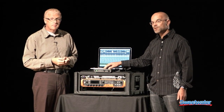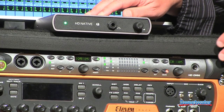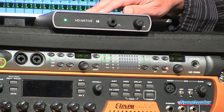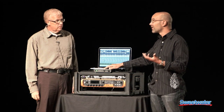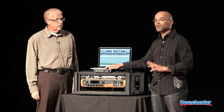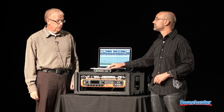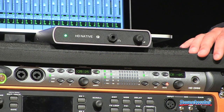One of the very cool features in this box is the built-in headphone amplification. This is a new development — we took the headphone amp from the HD Omni, which is already a very good headphone amp, and improved upon it. We gave it a lower noise floor and even more output, so you can hook up headphones up to 300 ohms of impedance — typically the ones that are hard to get volume out of — and there's more than enough volume. It's a very clean, clear-sounding headphone amplifier. There's an audiophile-quality headphone amp on the front with a volume control, and you can press the button on the front to use it as a mute switch as well.